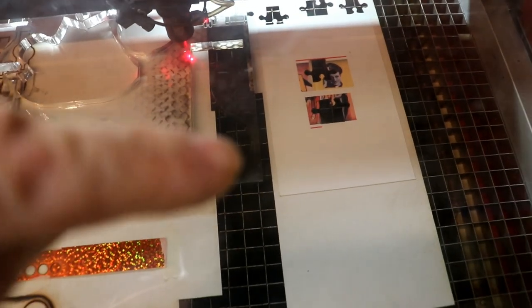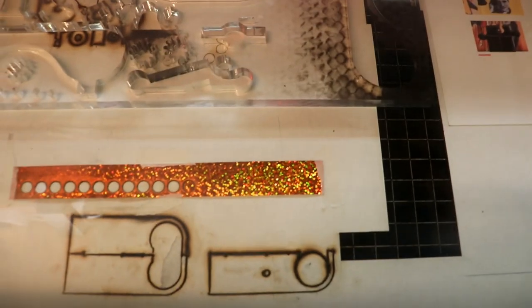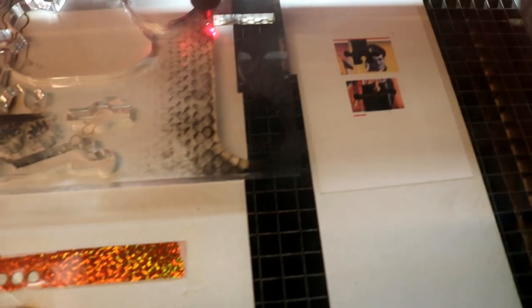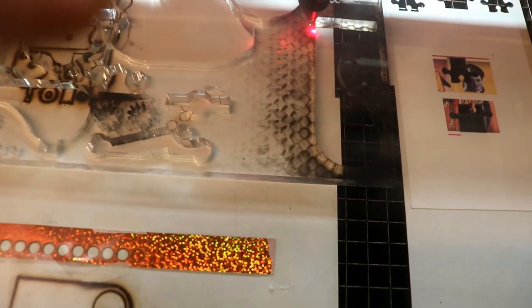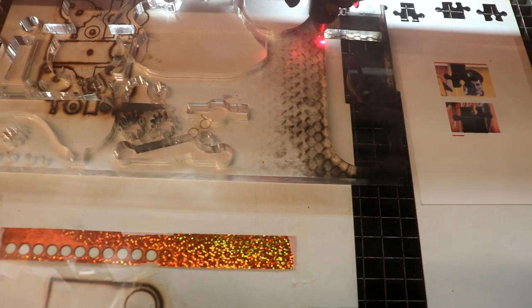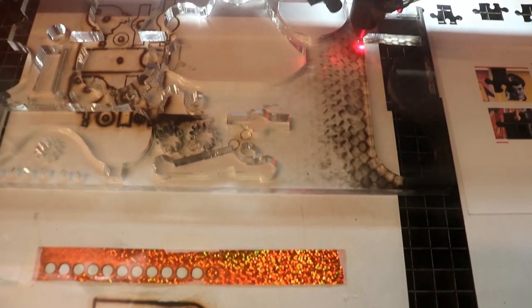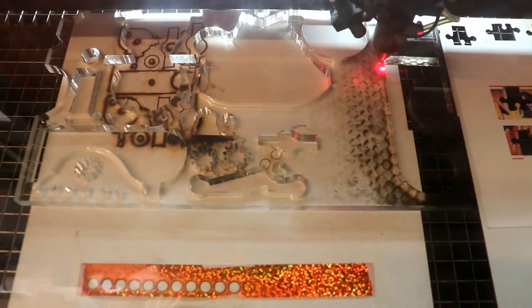So I've put my ventilation, air conditioning mesh stuff on the aluminium. So I've got my card underneath. The reason for using card is that I found with thicker acrylic, like 10mm acrylic, if you have white card underneath, the laser bounces back up a bit and actually puts a radius all around the underneath, which is nice, and also stops the little notches that are caused when the laser hits a part of the supporting mesh and then bounces up. I will give that a go.